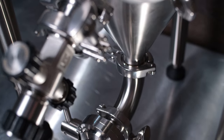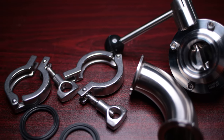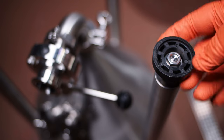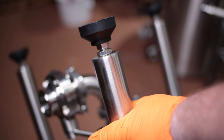Down below that is the inch and a half dump valve opening. They provide a 90 degree elbow as well as a butterfly valve with the unit stock standard. Also included are two caps so you can cap off both the valve and that additional accessory port above the transfer port. It has three welded legs with nylon composite adjustable feet for leveling, and you can screw in accessory leg extensions to raise the fermenter up for racking directly into a keg.